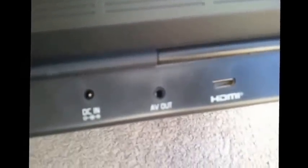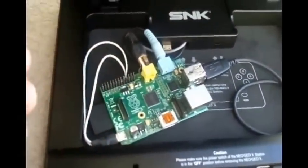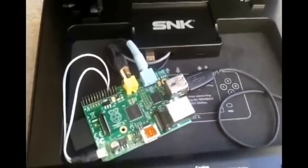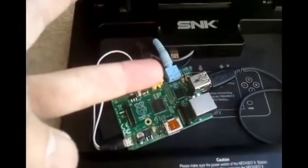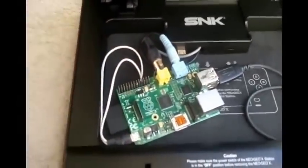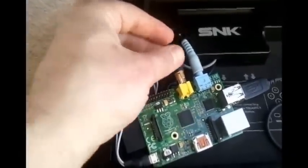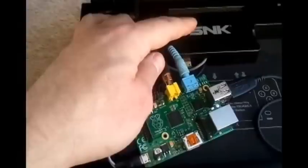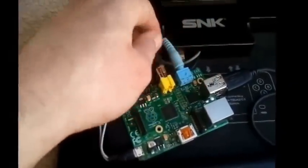On the back of this system, the AV out is like a little headphone jack type deal — it's a four-position or four-conductor 3.5mm jack. What that four conductor means is: one is left audio, one is right audio, one is composite video, and one is ground. I took the positive and negative from the composite video, put that in with the composite video and ground, and the left and right audio I wired those to that and grounded them as well.